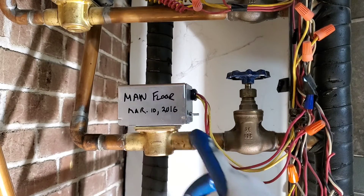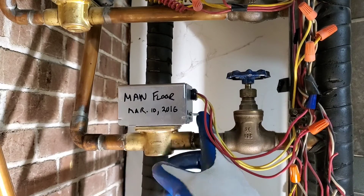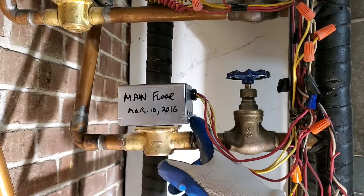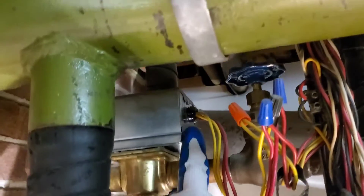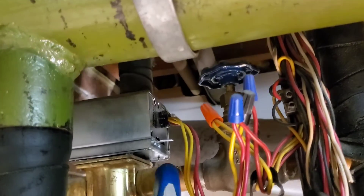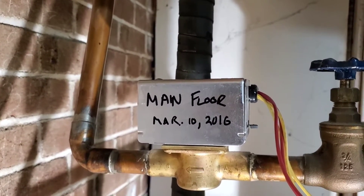When there's no call for heat, this is our zone valve. You have a lever here, and this should have resistance — but you see how it has no resistance? So this is a manual open. I'll show you the top floor zone valve that actually works properly. You see the resistance and how it springs back because it's spring-loaded. So I'm going to take the cover off and take a look inside the zone valve.